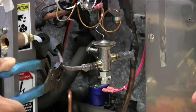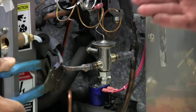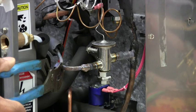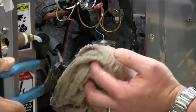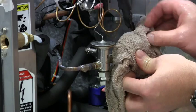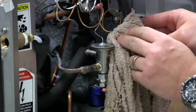Interestingly, we didn't wet wrap the valve. I can touch the top of this valve without burning my fingers — there is a little heat, but we didn't burn up the valve. As always, you still need to cool it down since the heat transfers down the copper pipe. You can see the steam coming off the lines after cooling — we don't want to burn or melt any wires that are close to them.